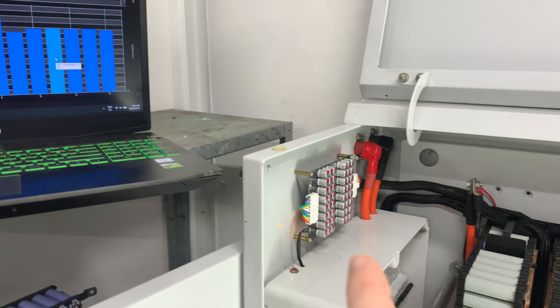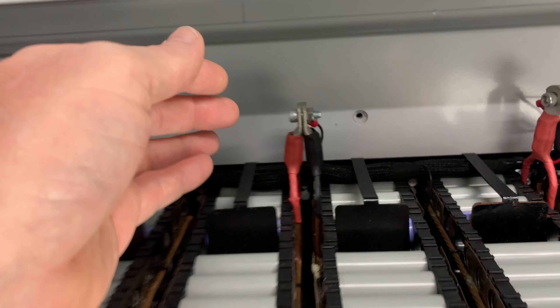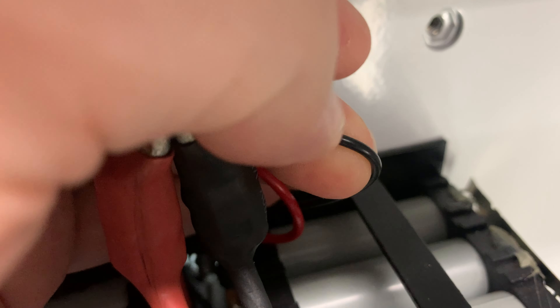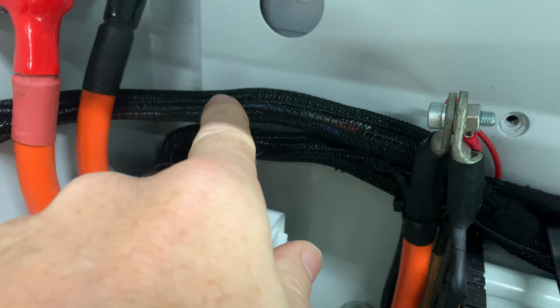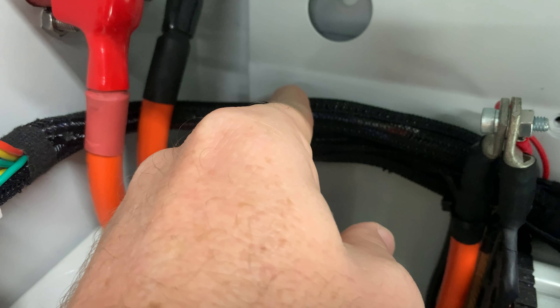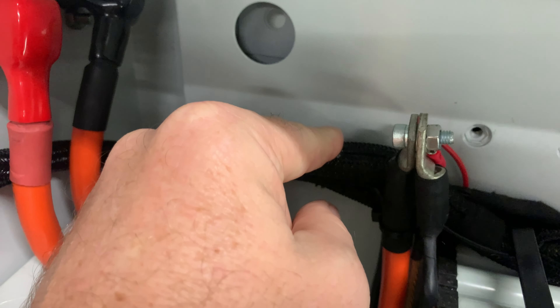To my mind that says something is broken — something in the balancer isn't working. I have to be really honest and say I honestly think it's got something to do with the cables. This is 3 millimeter cable and the packaging said it's good for 10 amps. Maybe I needed to crimp and solder. The joins from these cables are twisted, soldered together, and then shrink wrap over the top with nylon braid. Maybe something in there isn't as perfect as it should be.